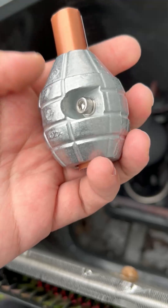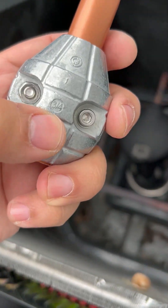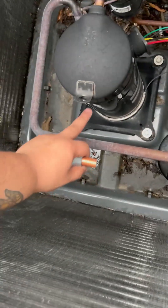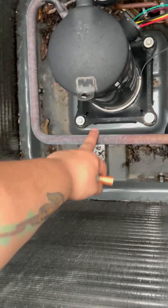you can install a corrosion inhibitor. You want to make sure it's the right size for your pipe — for me it's three-fourths and I've already tested it. You also want to install it at least six inches from the compressor, so I'm going to put mine right here.